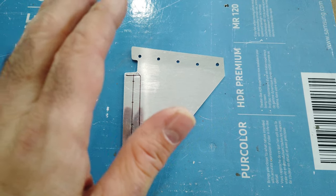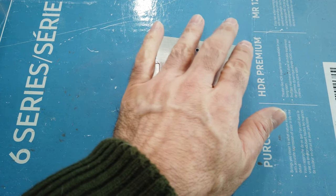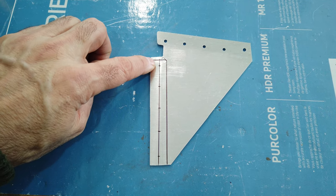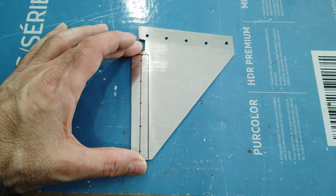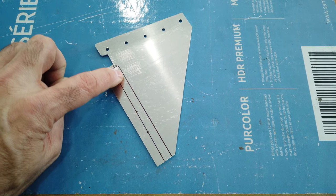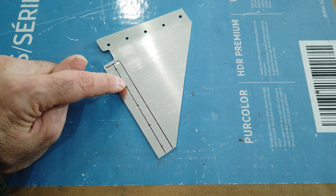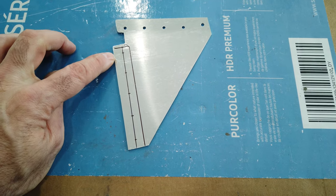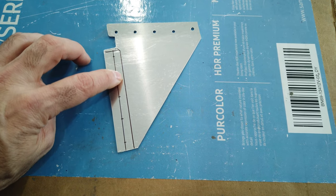All right, guys, we're getting close now. Bear with me. So here's the gusset back on the workbench. After I match drilled these holes, I had this Clecoed in place on the fuselage. And before I removed it, I traced the aluminum angle piece, which you see here. So this represents where the aluminum angle sits on the gusset. From here, I drew this line here. This represents the center line for the hole. Now, since this outer line represents the aluminum angle, I need to maintain edge distance from this line. So I did minimum edge distance, and I believe like a 32nd. I added just a little bit, and I marked this line. You can see that the line is not centered between this edge and this line. It's offset a little bit toward this line, which again represents the edge of the angle.